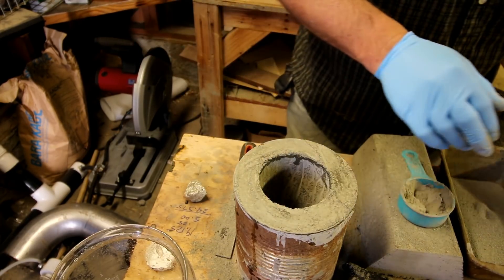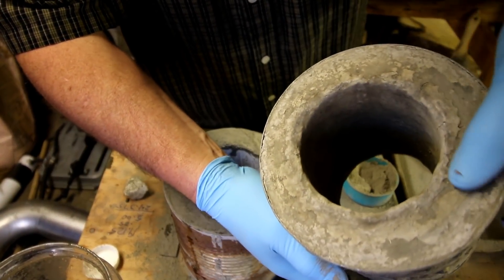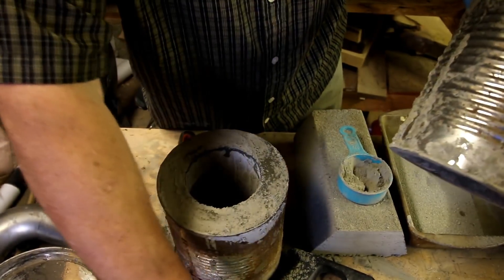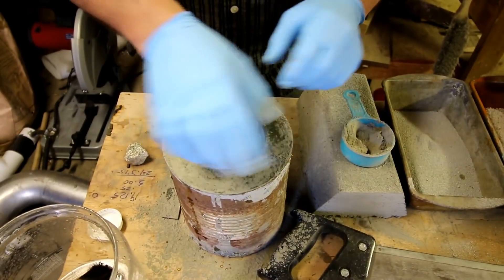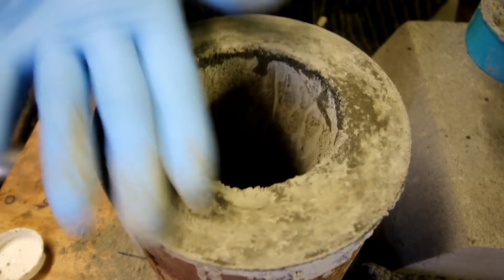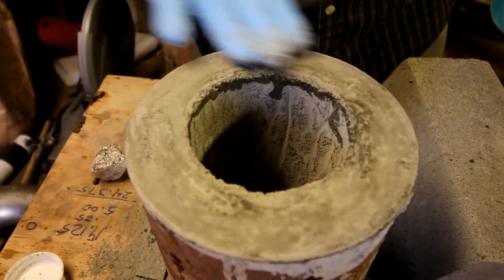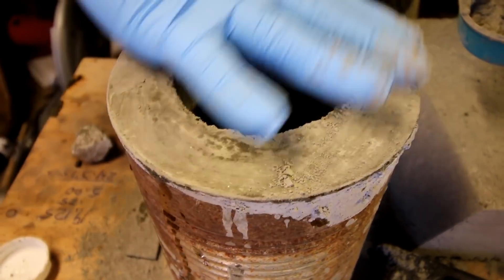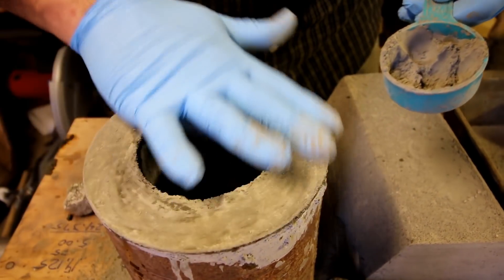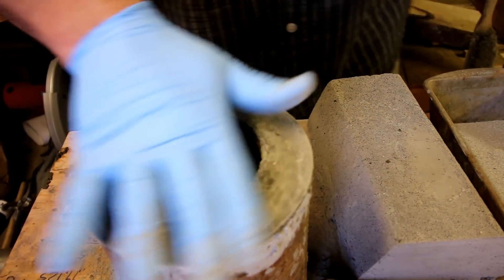Watch how smooth it's getting — it's filling all the pitted areas where the glass is. You can see the moisture and water glass soaking up into it. I kept doing that until the Portland cement basically stayed dry. When you see the outside layers that were flaking off, I'm not worried at all, because there's another layer underneath with water glass soaked in about a quarter of an inch, creating a glass-like coating around the whole refractory.